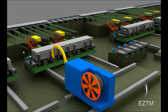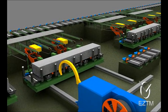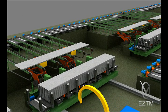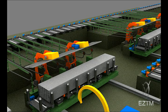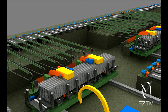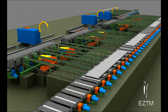The layers are transferred to the special manipulators with bracket electromagnet heads by the cross-chain conveyors. Depending on the product type, these manipulators tilt the layer and handle it onto the lowering piling beds. The next layer is handled without tilting.